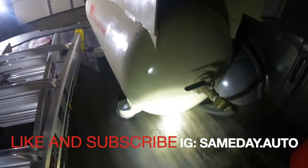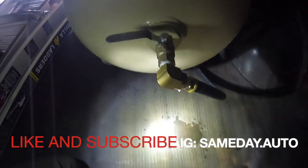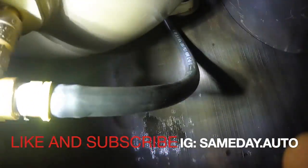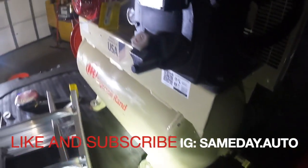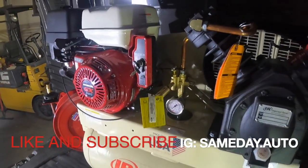I'm going to show you how to wire the battery to the tank so it'd be neat and clean. We'll probably put our battery right here out of the way, neat and clean, and show you how to get this tank fired up. That's the proper way to hook the line up. Do not go get Home Depot black pipe brass fittings — get the proper fittings, because if this explodes someone's going to get hurt, shrapnel, it's dangerous. Get a good quality hose. This is Parker hose — six feet of this piece was about $27, but quality over everything, safety when you're dealing with these compressors.